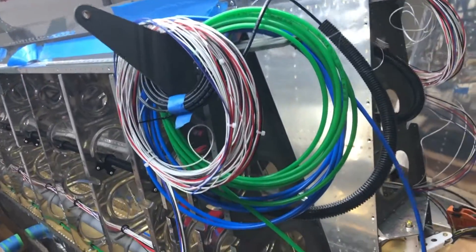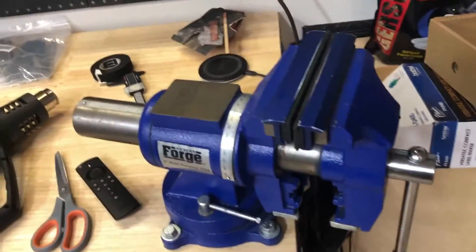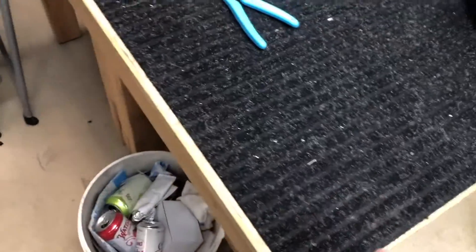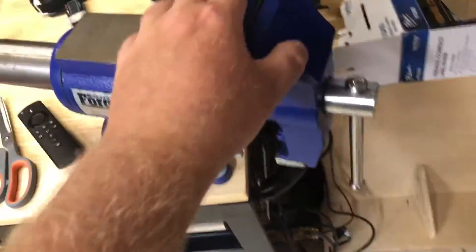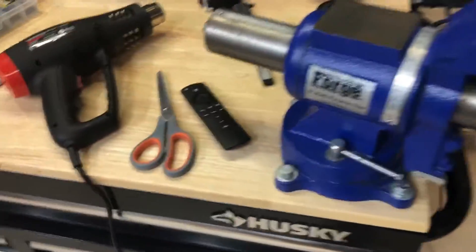Here's how I built the harnesses. I basically put the wire in the vice grips and stretched it out along my garage, using my five-foot table to measure — so I stretched my hands out at 5, 10, 15, 20 feet, etc. As I built the harnesses, I placed them in and every two or three feet put a zip tie on them until they stretched out. Then I heat shrunk the tip to push it through.